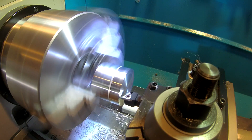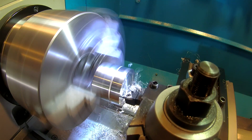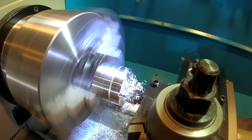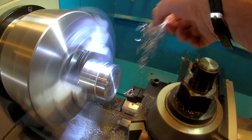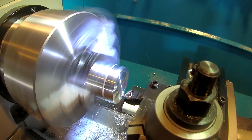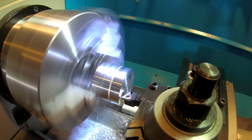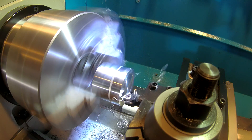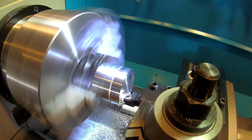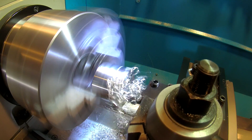I don't have any inserts designed specifically for notching a face like this. I had a couple that might have worked, but I was trying this one. I set the cutter parallel to the axis of the lathe — sorry, not perpendicular — and perpendicular to the surface I was going to cut. This is my first attempt ever at cutting a groove like this. One side is going to have a slope where the triangle is at a 60-degree angle, but that doesn't matter because I only care about the outside edge being perpendicular to the surface and parallel to the axis of the part. You'll see me indicate on it later.